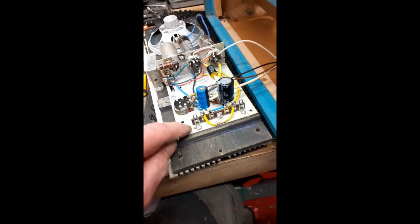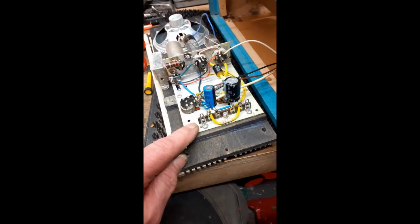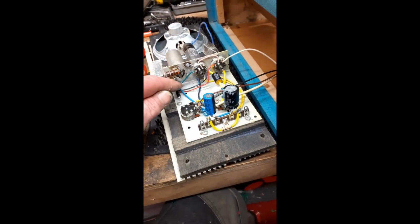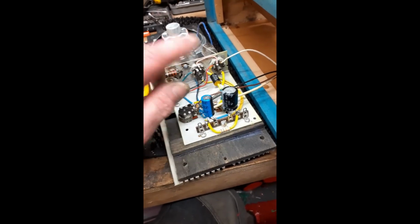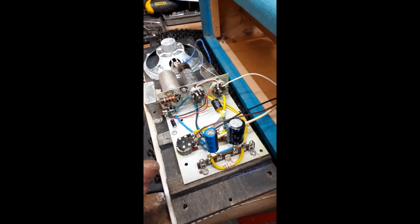They're not electrically connected to the chassis over here. If you do, you're liable to get hum, because the current will find the easiest path, and it will go through the chassis, obviously, right past the volume control. Not good. Always maintain the earthing arrangements, grounding I should say, as they were manufactured, and then you can't go wrong, hopefully.